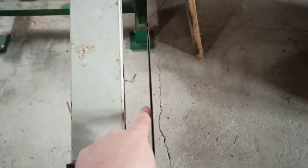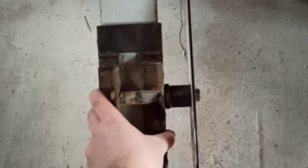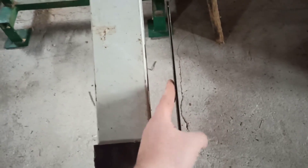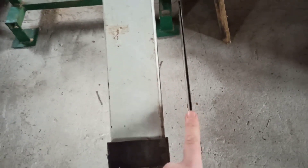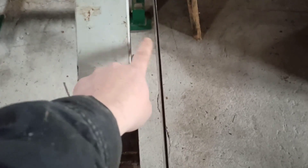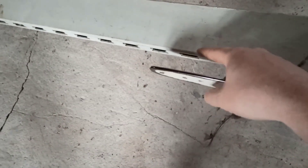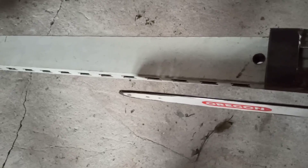There was one thing I had trouble with: the saw blade has to be parallel everywhere, and there cannot be any movement or play. If there's play here or here, you will get a vibrating blade, and then you lose a lot of wood and you cut much slower. The best way to measure this is to measure here, then turn it around and measure here again — the difference should be less than a millimeter, preferably exactly the same.